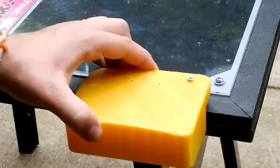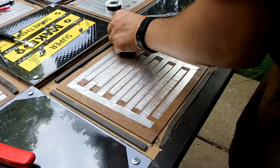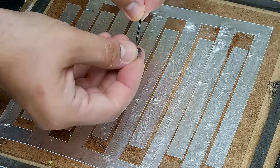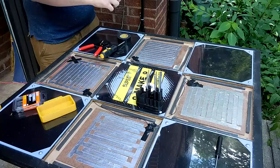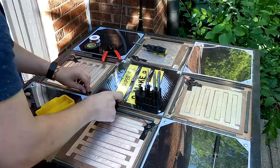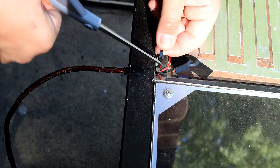Once the enclosure finished printing, I screwed the bottom half of the enclosure into a corner of the dance pad's border, and removed the four button pad assemblies from the dance pad. Thereafter, I drilled a wire routing hole through the middle of the dance pad's front border. To wire up the dance pad, I connected four of the button contacts — one under each button pad — together using wire. These contacts will be the connection to the microcontroller's ground line. I then wrapped a washer around the ends of each wire piece to increase the surface area for the electrical connection between each button contact, and fastened it in place with electrical tape. I then connected a single, longer wire to each of the remaining button pads, running these and a longer ground wire through the routing hole, and adding electrical tape where necessary to keep the wires in place. To keep the wires organized, I slipped braided tubing across the wire bundle and attached a zip tie around the tubing on both sides of the routing hole to provide strain relief.